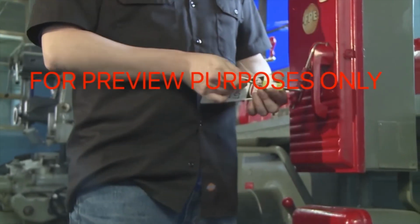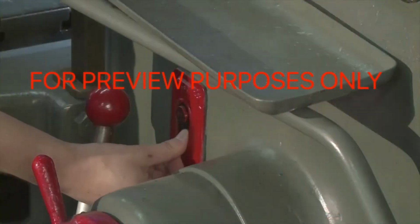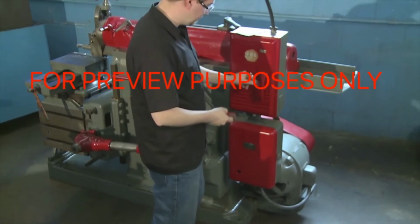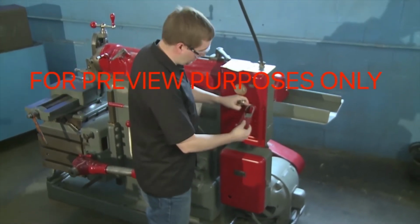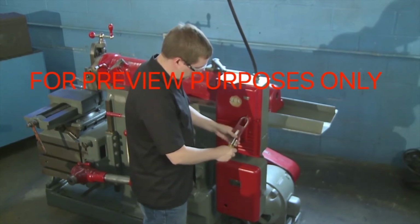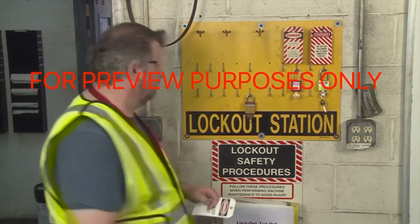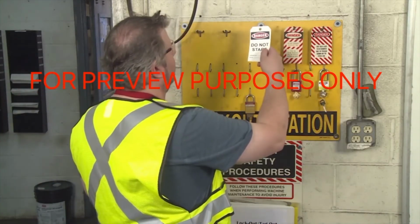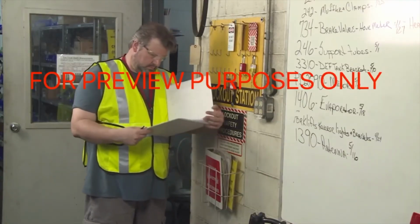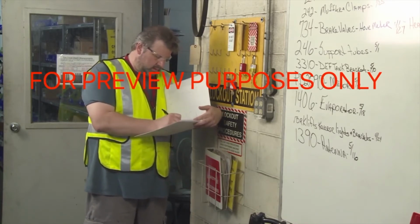First, lockout-tagout devices are removed and the release procedure is followed. The machine is then restarted. Once the temporary restart has been accomplished, normal procedures must again be followed to re-secure the lockout-tagout devices and isolate the machine's energy sources. At the completion of any type of lockout-tagout procedure, the locks and tags that have been used must be returned to their home. They should also be signed in the lockout-tagout log if one is being used.